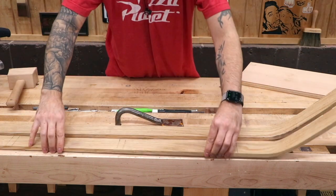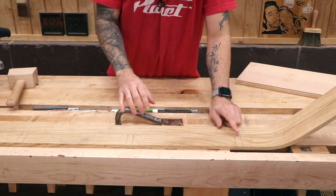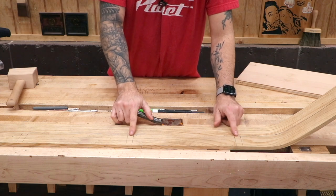The main foundation of this sled will consist of supports that span the two runners — imagine a piece of wood going across like this. You could certainly join them with just screws, but we can do one better by making a very shallow dado that the support can drop into. Then with a little glue and screws for reinforcement, it should be really nice and strong. We're gonna make the dados using our router, and I've already marked the locations.